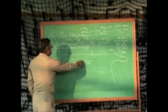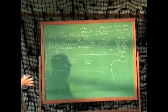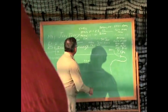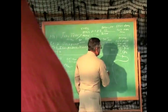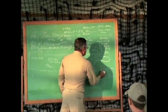When you reduce power, you're taking the fuel off, which lets it slow down, you still got that high amount of air flowing through it, and it cools it. If you do it fast enough, it's called shock cooling. Lots of things break when they start shock cooling, things start to crack. So we do everything slow. We don't change power settings unless we just absolutely have to. Radials don't like it.